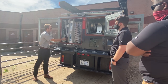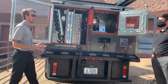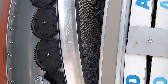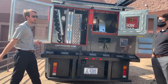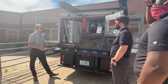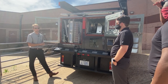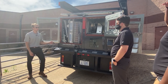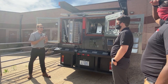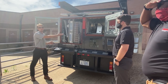Once we get into the unit, we go through a bird screen and then our metal mesh cleanable filter — a two-inch-thick cleanable metal mesh filter, standard on most of our outdoor air units. Once past the pre-filtering, we want to know the load in the mixed air area — temperature and humidity of the air we're processing. That comes from our web of temperature sensors: wires running across the intake averaging all the air moving in, so we know precisely how much load we're taking on.